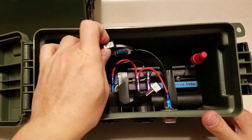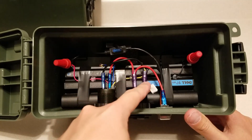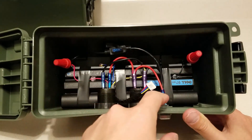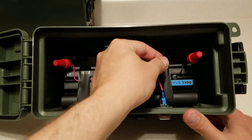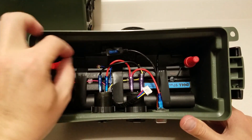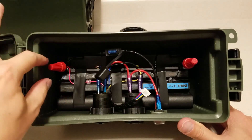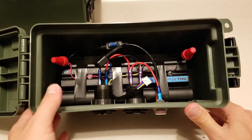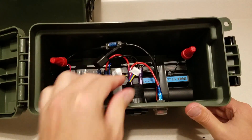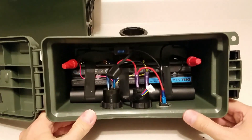Super simple inside. I have the battery pack and all the wires that came with it — the whole thing came as a kit, all pre-wired, super easy. All you have to do is hook on to your positive and negative terminals. I have a negative wire here going to the negative power lead, just twisted on. Then I have the positive wire coming off — I replaced it with a wire that has an inline fuse. So the positive line has a fuse and hooks to the positive terminal. It's just the battery powering these two devices with a power switch.